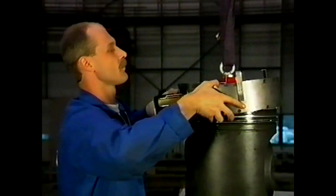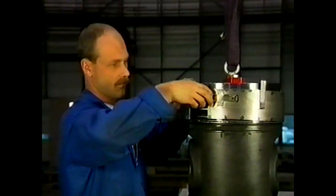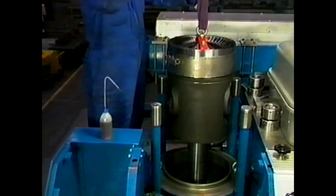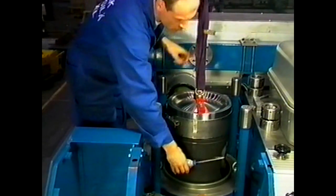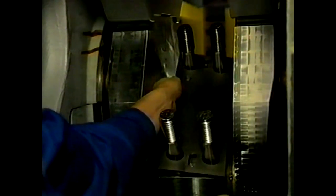Fit the clamp around the piston crown — the piston rings are already forced into their grooves when the clamp is closed. On one side the connecting rod is marked 'camshaft side'; this marking corresponds with the marked position on the big end bearing block. Carefully lower the piston into the liner with the marking camshaft side pointing towards the camshaft side. Now apply a layer of clean lube oil to the piston skirt. Fit the intermediate plate to the connecting big end bearing caps — make sure that the plate is clean and undamaged when it is fitted.